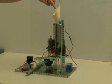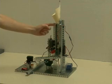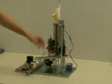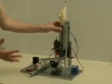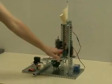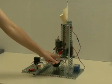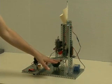All right, this is the hopper. Marbles are poured into the hopper, and then they pretty much go in this shaft here, single file. There is a gear back here that turns 10 degrees every time, which will send one marble out down to our switch right here. Underneath our switch we have a light sensor.